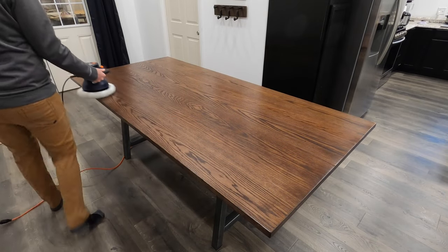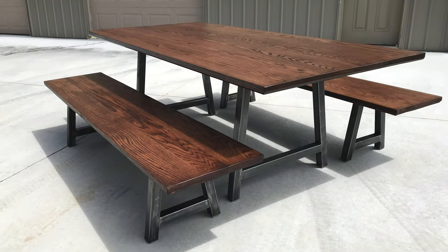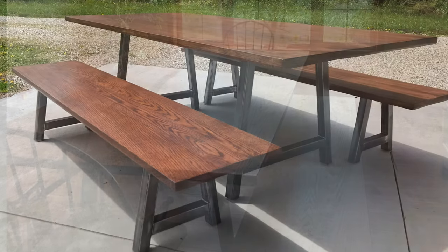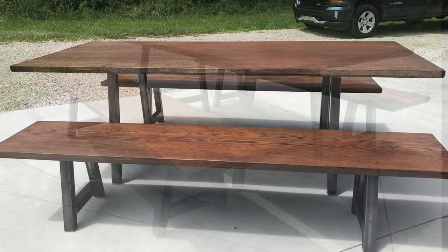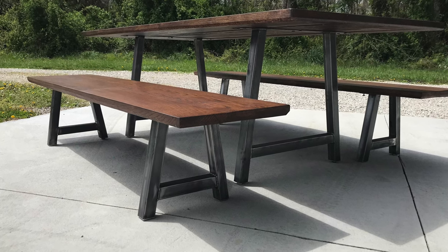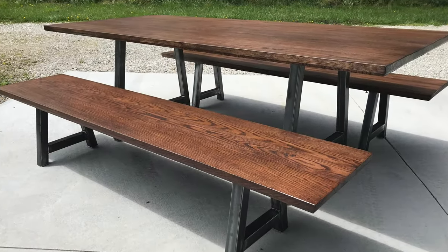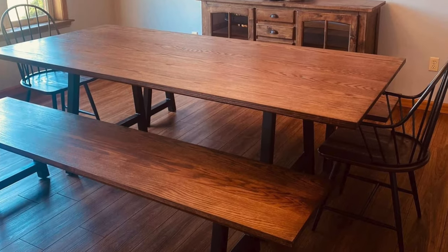The buffing is the last step. After that you just want to leave the table alone to cure — Rubio takes up to seven days to cure with the hardener, so try to leave it alone the best you can. Here are a couple pictures of the table and benches when they are finished up. I thought everything turned out awesome — this was a super fun build. I got to try a lot of different things that I haven't done before including using Rubio, those threaded inserts, furniture bolts, and the metal legs. Overall I just really enjoyed this build.